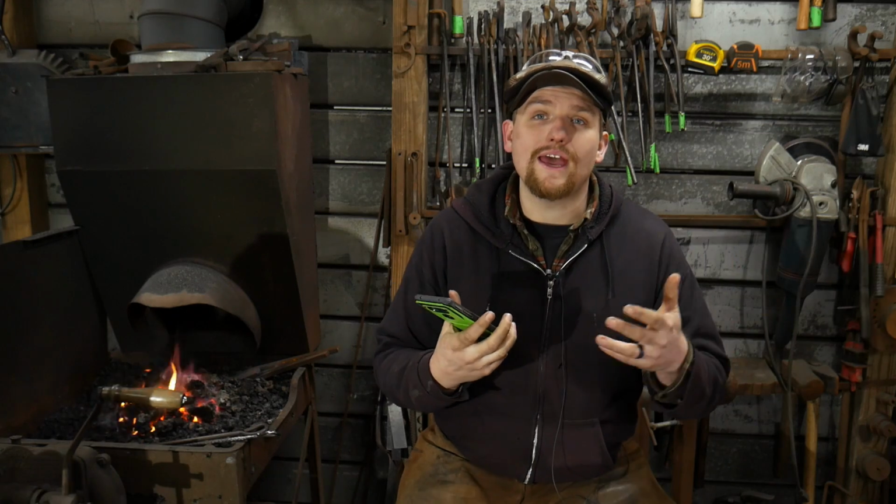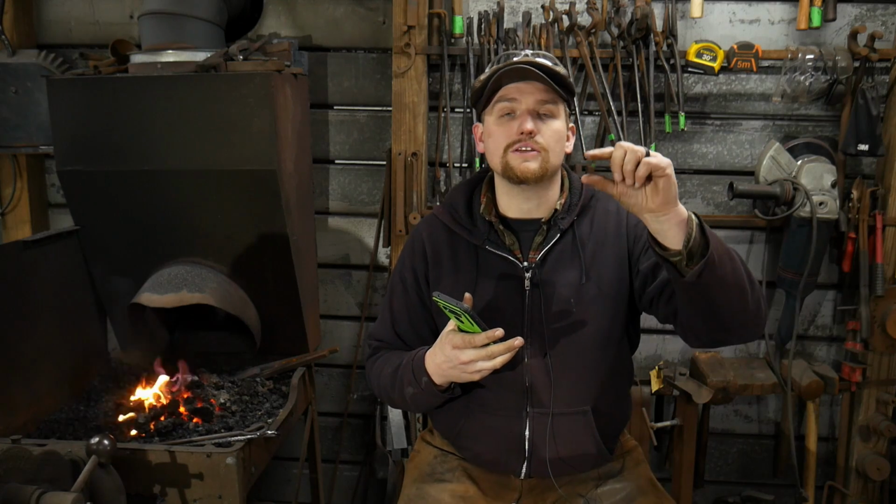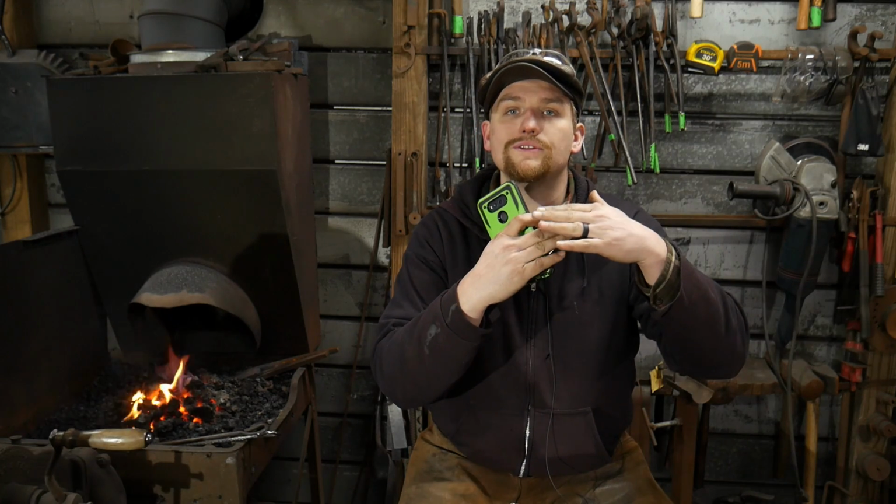So it's not actually weldable at that point, and it doesn't stick. And you say, man, what the heck? It's because you whacked it too darn hard. That's the reason most smiths prefer to take little light taps just to push those two molten surfaces together